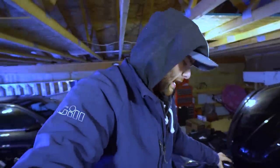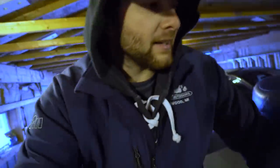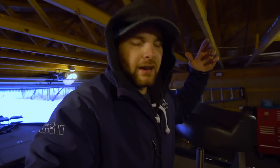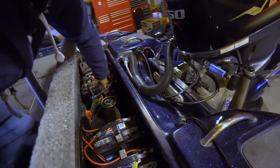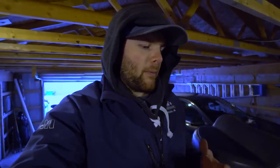We're going to look back in the battery compartment because I did add another battery to the boat. My boat came with four — it's a 36-volt system, so you have three trolling batteries and the starting battery. I added another battery, so I have five batteries now. That's really nice for running my graphs and anything that isn't going straight to my motor. I don't like to have things running off my starting battery because it can be slow to crank if it's been drained by the graphs and live well pumps. I do have to use a separate charger — I have a four-bank charger in there that charges the trolling batteries and starting battery. I also carry a spare prop, and Phoenix gives you a dedicated area to store it right in the boat.